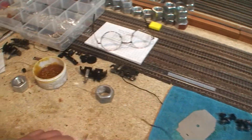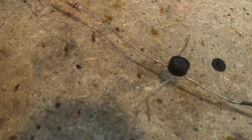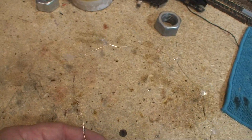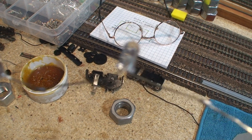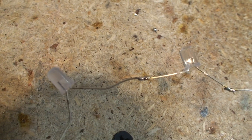As you've seen in my other videos, this here is my test ring. I've got a bunch of LEDs, a bridge rectifier, a 1K resistor, and then a loop of LEDs. What this does is help me remember exactly which way everything is supposed to be wired. If you don't have one of these, you should make one — that way you don't have to figure out every time if you're doing it right or wrong. It shows me which side the big piece should be on and which side the little piece should be on to get LEDs in the loop.